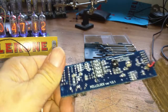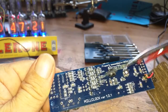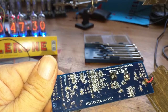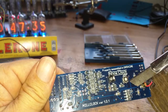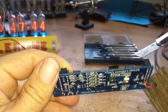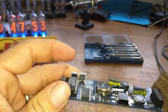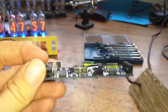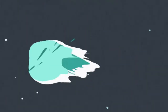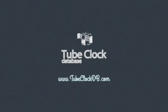This stuff on the back I was a little confused about, but I'm starting to get an idea. There are 2, 4, 6, 8, 10 driver circuits here - I guess there are 4 anode drivers for the 4 tubes and another one for the neon. Still don't know what this trimmer is for, and I have no idea what that is - it looks like a switch that's lost its top. So that's it - quite a neat little board, not very complicated and very small.